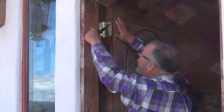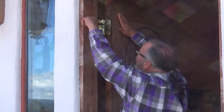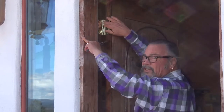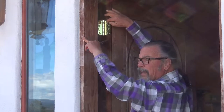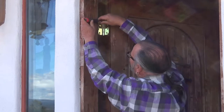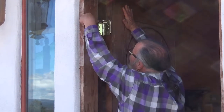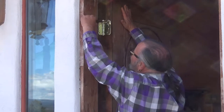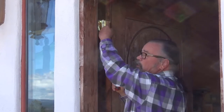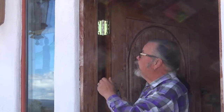Checking the screws — so is that one, and that one. There's one more and I can see that the screw head is proud of the countersunk hole in the hinge, so I'm going to tighten that one a little bit as well. That screw has a stripped out hole, so I'll need to get a couple more matchsticks and repeat what I did over here.